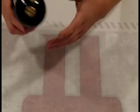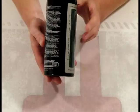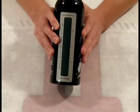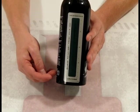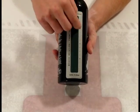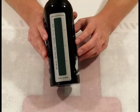I've also got some specialty CO2 tanks. This is a JT IVT tank — it has an o-ring, a pin valve, and a burst disc in a slightly different location. Their claim to fame is that you can kind of tell how much CO2 you have left. There's a magnetic floating ball inside, so when you fill this tank with liquid CO2 it floats to the level. You can hold it, swirl it around, and that magnetic strip will make a line somewhere on the gauge. It's not perfect, but it's better than most CO2 tanks.